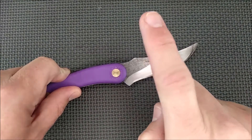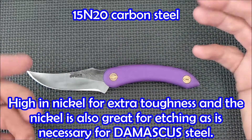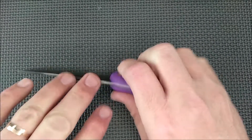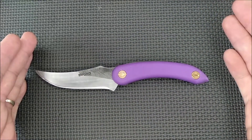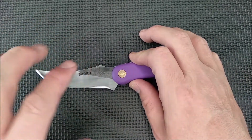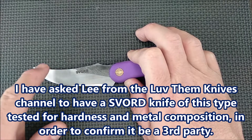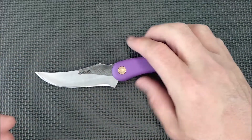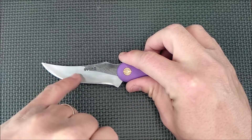The steel used here is 15N20, also known as L6, which is a very tough, quite wear-resistant steel that stays sharp for quite a while and is not too hard to resharpen. The Rockwell hardness range on this can be very wide — everything from the low 50s, like 53, all the way up to 64. Generally it's around 61, which is what L6 is typically hardened to. This is one of the main steels used in Damascus, because of how it etches. This and carbon 1095 are used in Damascus steel, though 1095 is a little softer than the 15N20.